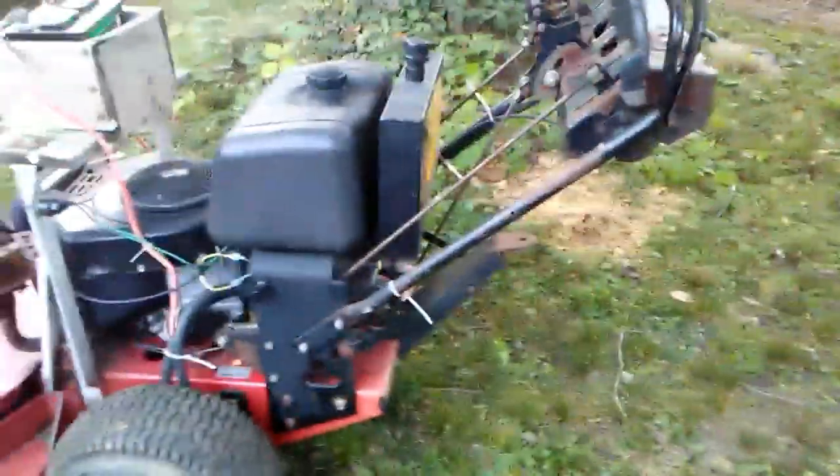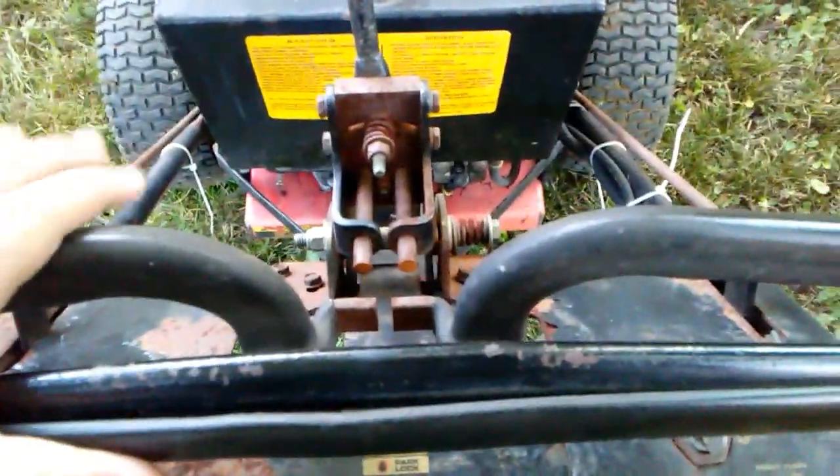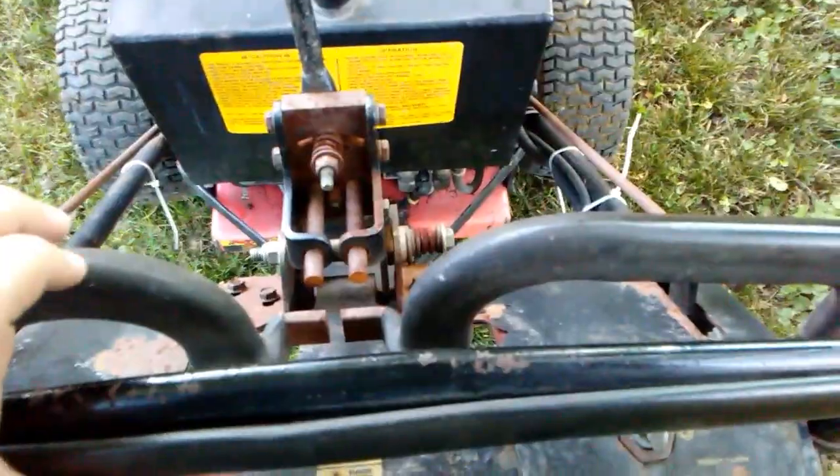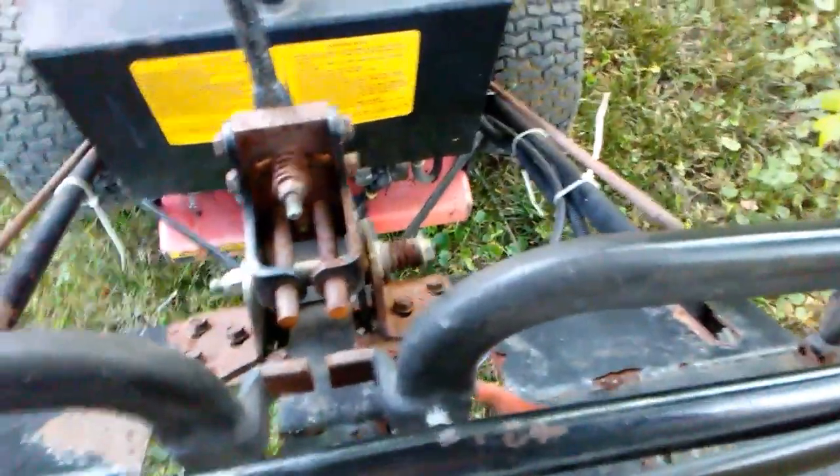So far I like it. It's not the hydrostatic like Scag's normal ones — it's actually what I think they call the loop system. You have to hold this bar up, then pull both of these back to go forward. When you pull them back a little bit it takes the safety off, and it moves them both forward. All you have to do is pull it back when you want to stop — it automatically goes forward unless you let go.